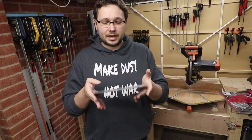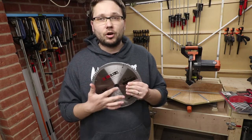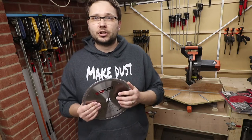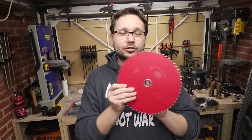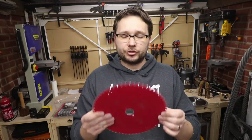Saxton blades actually have two options — I've got the 80 teeth and the 40 teeth blades — and they both come with 25.4 millimeter boreholes, so you do not need any reducing rings, which increases the safety of using those. The Freud blade has got a 30 millimeter borehole, so I had to use a reducing ring as you can see here. I've talked about reducing rings for these blades a bit more in my previous video where I explored using different branded blades for the Evolution table saw, so I'll link that up above and down below in the description.